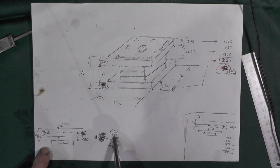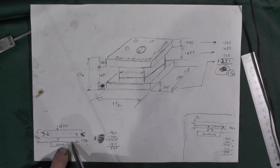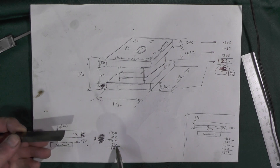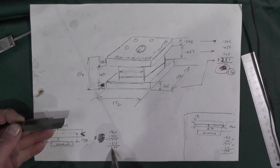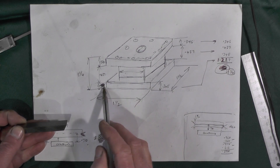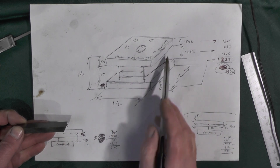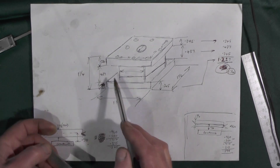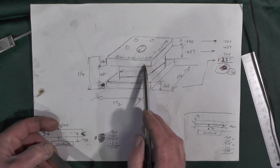I've taken a quarter of an inch off to get to my centre line — that's 0.250 — giving me 0.710 from the compound to the centre line. My tool is 3/8 square, so if I take 3/8 off that 0.710, that gives me 0.345 for the size of the bottom portion of the tool post. I'll put a slot all the way around this tool post 7/16th deep to give a bit of space at the top.